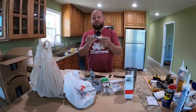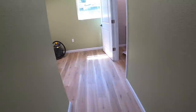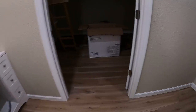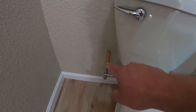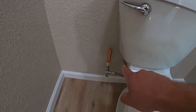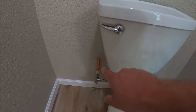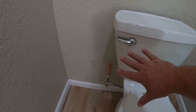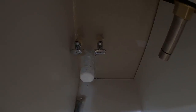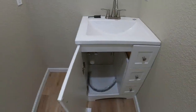If you can assemble on the counter and then go glue it on, you'll get a much better fit and avoid cracking something. So I'll put all these cutoff valves together, then cut off pipe and install them at the vanities and toilets. In the bathroom I've got a quarter-turn cutoff valve, a hammer arrester, and a hose that goes straight to the bottom of the toilet — very easy hookup. I'll probably paint those fittings and the hammer arrester the same color as the wall so they blend in. Underneath the sink: two quarter-turn cutoff valves, hot on the left, cold on the right.